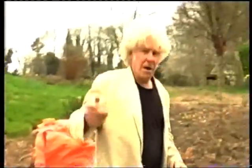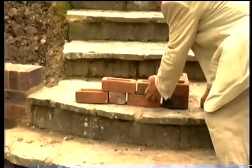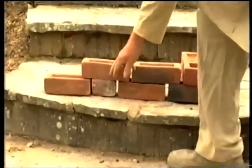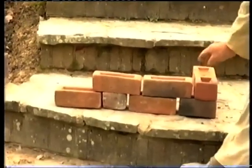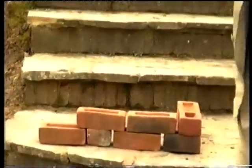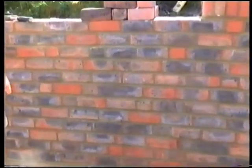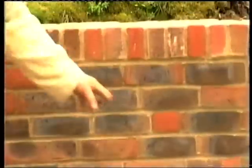Now, I'm back again. This is what you do for the corners. On the bottom, what we do: you have your three-quarter, and then you can have a stretcher — which is a full brick to those that don't know — then a header. There's no pattern. You can now put four stretchers, then a header. There is no mix. You can see there's no pattern to the bond — one, two stretchers, header. You also get the reds of the brick come out when you do this, and you're not looking for upright perps. So if you have to cut a brick in the wall, it's not too bad.